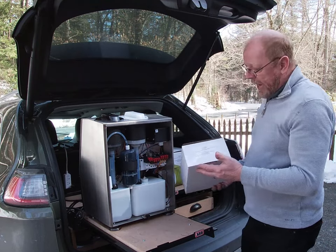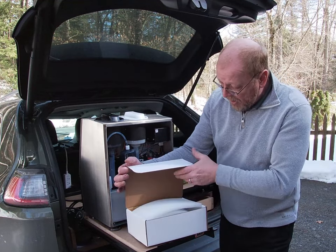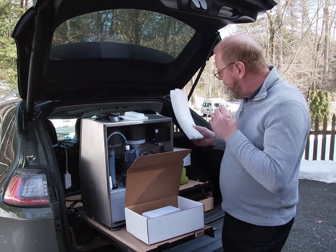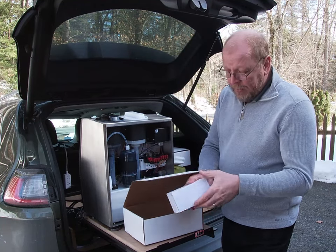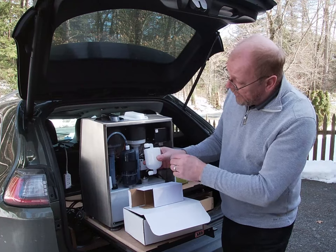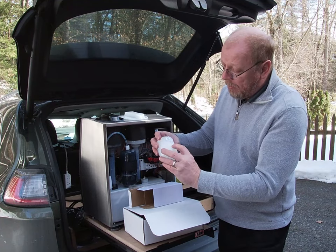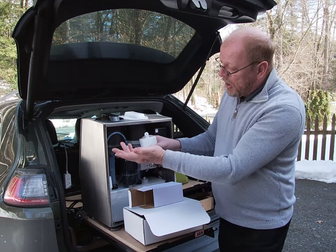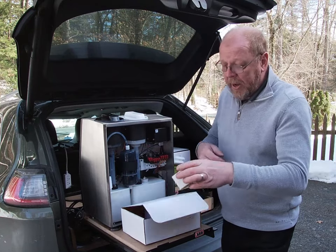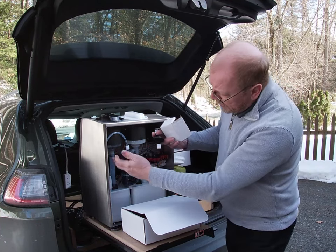The filter kits come in boxes like this, and inside this one is the 5,000 hour kit. Inside the kit comes two clean air filters that go in the front — I'll show you how to put those in a little bit. We have the main filter, which comes in like this. As you can see the difference: that's a 10,000, this is a 5,000, then we have a 2,000 smaller. It has a direction arrow pointing up, so we are going from bottom to top. Also in the kit we have the little pre-pump filter, which goes right at the back there.